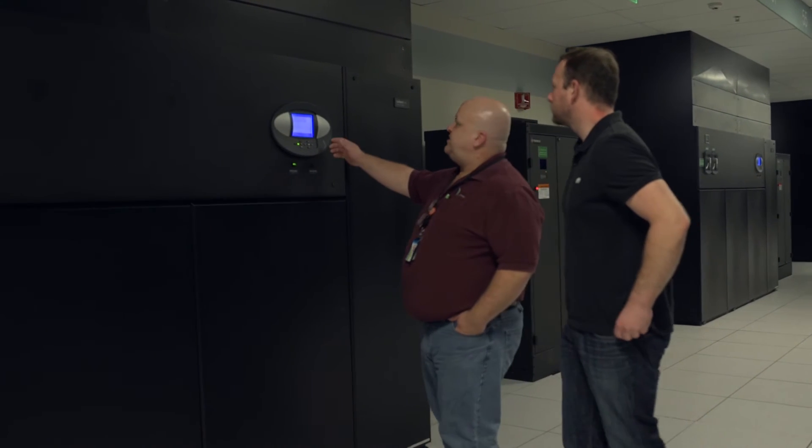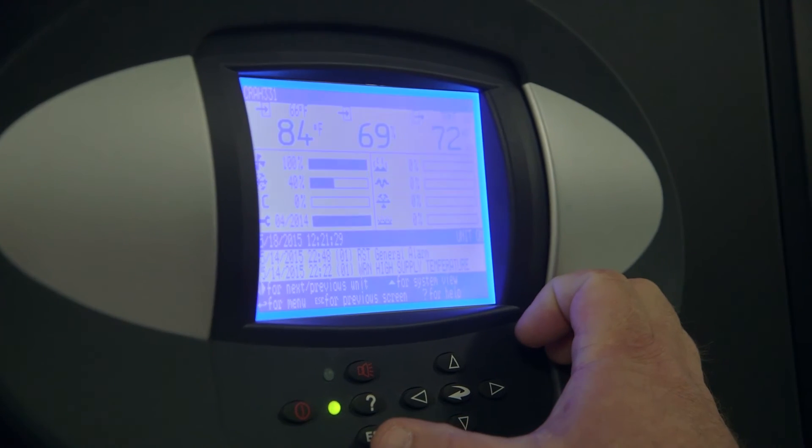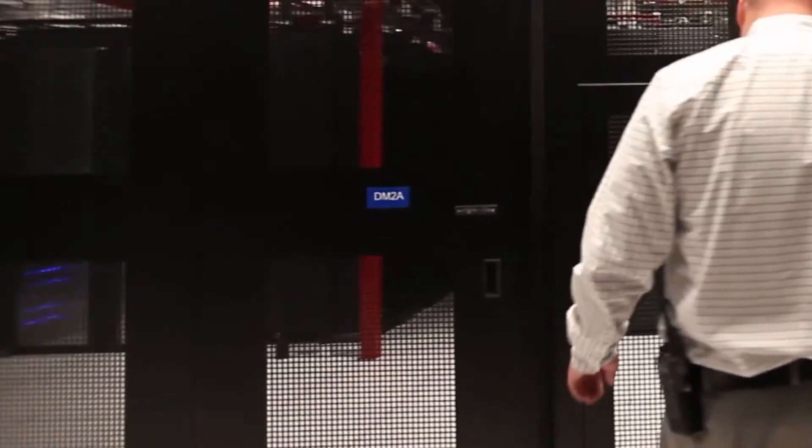One of the big changes we're seeing in the industry is how we handle power into the data center. Traditionally, you're going to see these large UPSs — uninterruptible power supplies — which also have these huge banks of batteries. What OCP is doing is instead bringing the power straight into the rack without a UPS, and then at the rack level there's a local battery and a DC power supply right there that powers the entire rack.